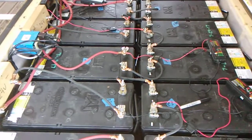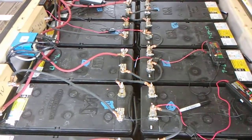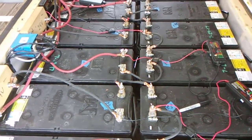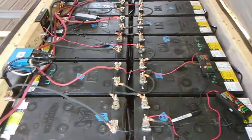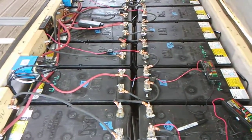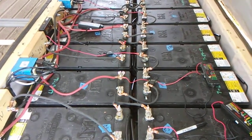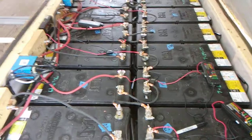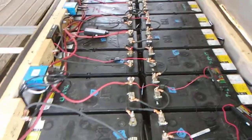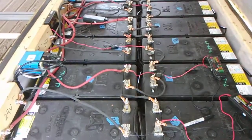It took a period of time, but over a couple of months those high back-charge figures ended up dropping down to next to nothing. So with all these used batteries, my back-current when they're fully charged is now somewhere around a couple of amps — it would have been 20 or even higher without the desulfators. I thought some of you might find that interesting.